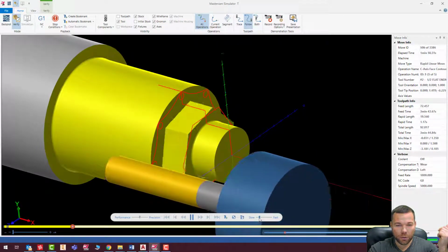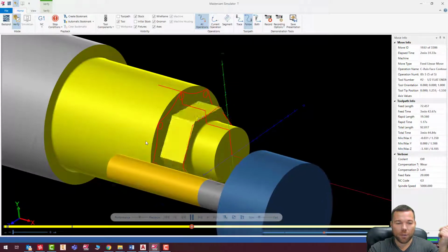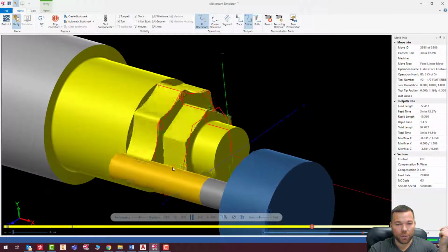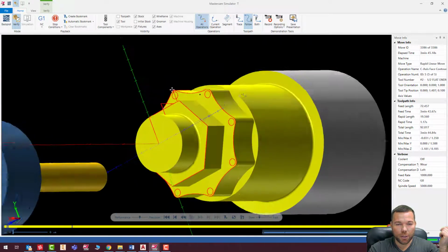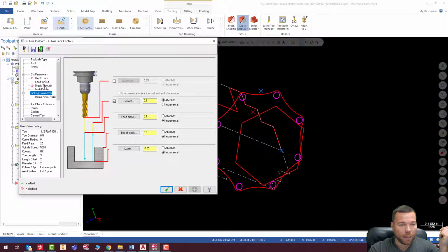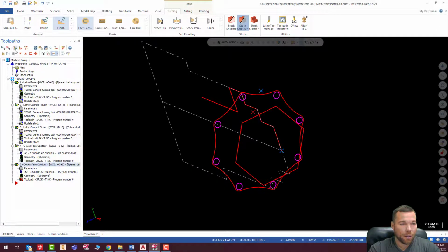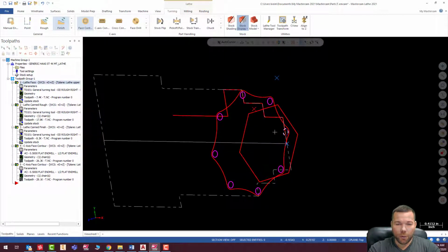See here. Cuts that. Well, looks like I don't need that first cut. So I can get rid of that. Second cut is good. And there's my finish. And that looks great. All right, so I'm going to go back and adjust that. I'm going to take away that multi-pass cut because there's no reason to just cut air. So I'll make that 2. So 2 was good for that. I thought it was cutting a little more off, but I guess not. Okay, so there we go.